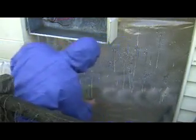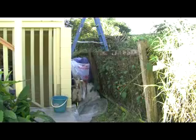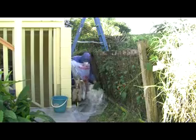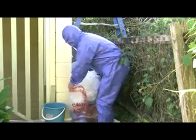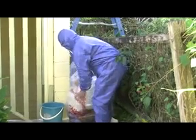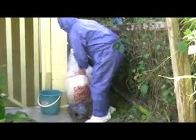In the final clean-up, Stefan uses the water and glue mixture to wet down the drop sheets where any dust or residue may have collected. Now he folds all the sheets in half and then on themselves to a manageable size and puts them into the approved asbestos disposal bag, making sure that every trace of debris has been captured.